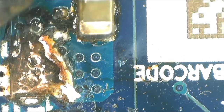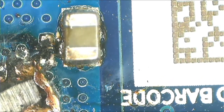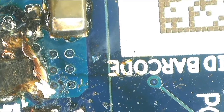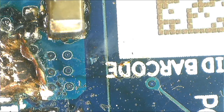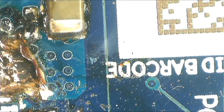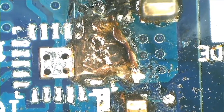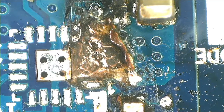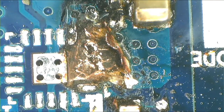The 19 volts pad is up. I'm pulling it up because I want to be sure it doesn't touch the ground. So underneath this pad I will put the soldering ink mask and let it dry. Once it's dry I'll be able to repair the spot. Now this port is only missing the 19 volts. Before we continue, I want to check something — let's check if this port's 19 volt is not shorted to ground.